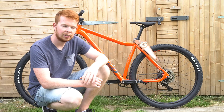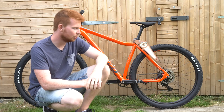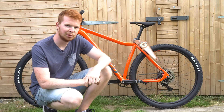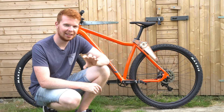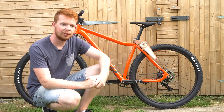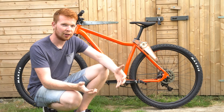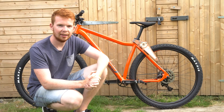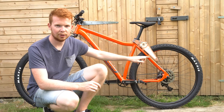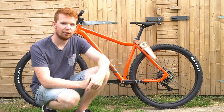This project is going to be quite long-term — I'm not going to rush it over two or three weeks. I want this to be the last electric bike version I make for quite a while, so I want it done as well as possible. You may be wondering why I'm not going with a mid-drive system where the motor drives the main chain. The reason is just complexity — I don't really want to mess around with different chains, and I'm not sure the stock chain would take the amount of torque this motor produces. The belt system I ran previously was pretty reliable and the belts lasted forever.